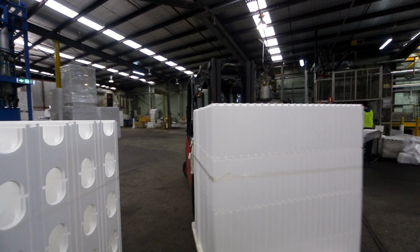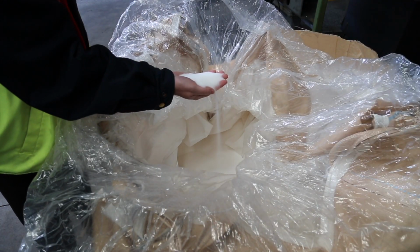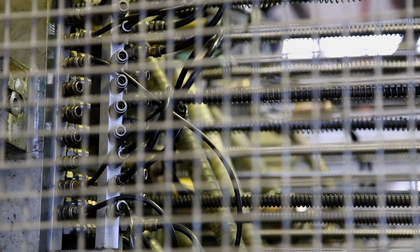The process to making this polystyrene product though, in relative terms, is remarkably simple. With sand-like plastic granules being machine blasted into fluffed up foam beads, these foam beads are next injected into aluminium moulds. They're not much different to beanbag material, basically fluffed up polystyrene foam beads, forced into an aluminium mould, and then we push steam into that mould under great pressure. The steam melts the plastic and forces the beads together. So there's no other chemical added, it's just hot steam and plastic foam.